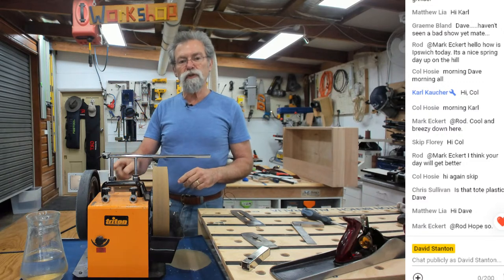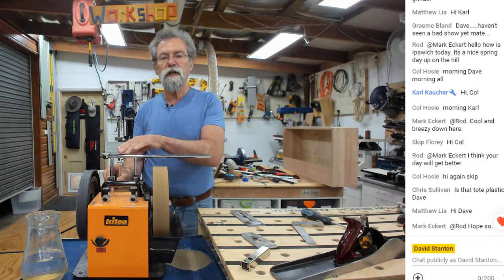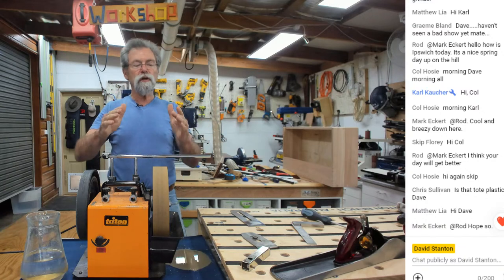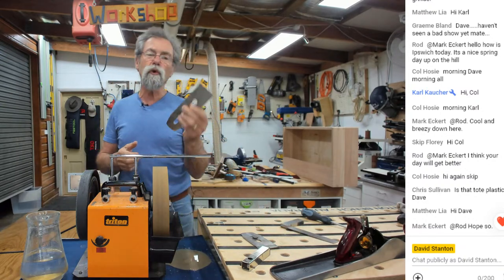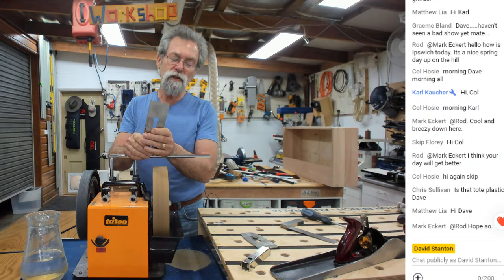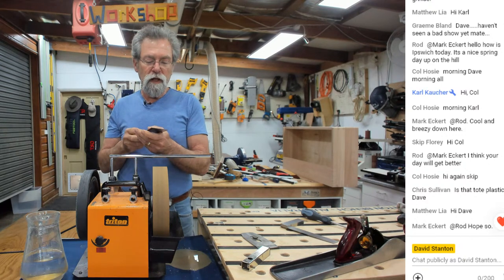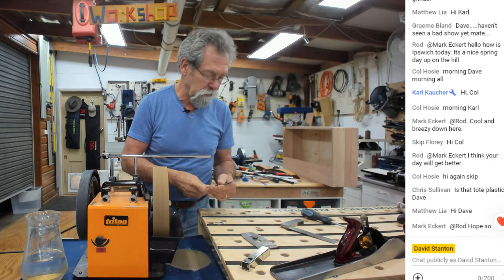Now it's important, there's two screws here. I'm not going to bring the camera around the back, but there's two screws that are clamping screws. It's important to clamp both of them up tight, because when I start putting weight here, if I don't tighten or clamp up on this side, that whole arm is going to do this, and it's not going to give me a square end on the end of the blade. Now with a plane blade, it is crucial. I can't stress how important it is to make sure that that's dead square. It's got to be perfect. If not, that's what your lateral adjustment's for, to try and take that fine little bit out if you've got it slightly wrong. But if it's wonky, the plane will dig in one side and the other side will just be going along for the ride, not doing anything.